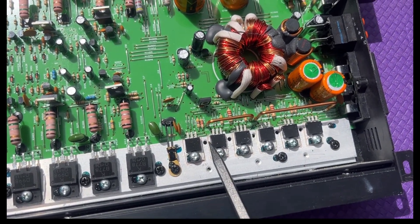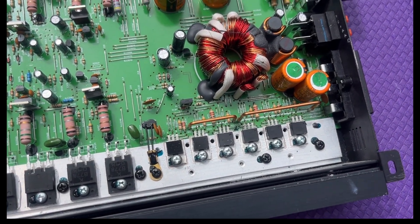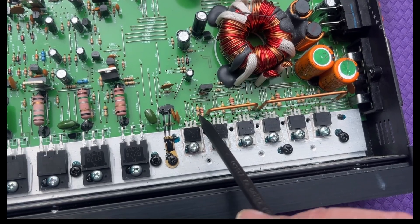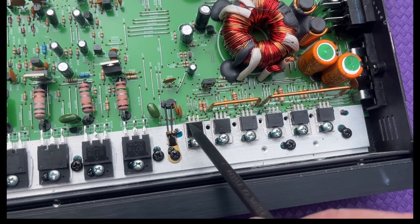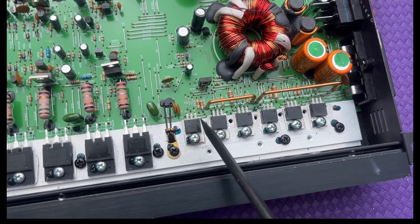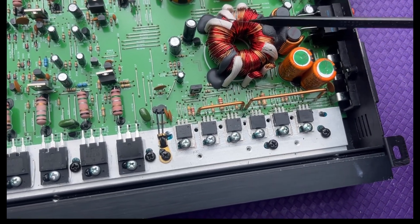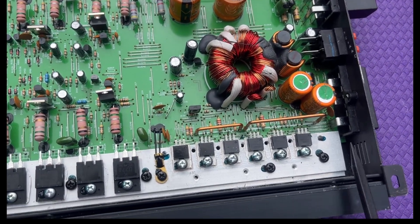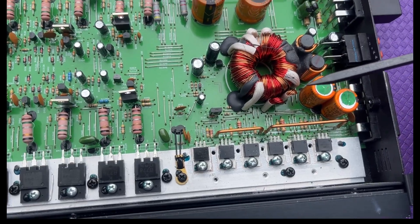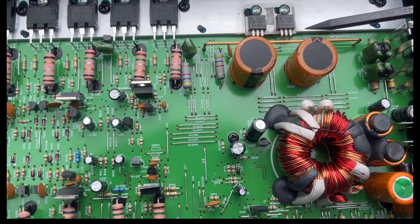The alternating current is created by these power transistors. Power transistors are basically high-speed switches that are controlled by a chip called a pulse width modulator. There's a bunch of resistors and other things to control the voltage getting to these transistors. They have three terminals and they switch back and forth very, very quickly — 20,000 to 40,000 times a second, depending on the speed at which you want the transformer alternating current to switch. In this case there are six of them, and they switch back and forth creating this alternating current, which then goes to these two little devices here called rectifiers.